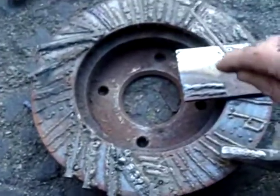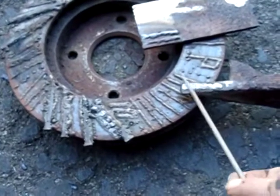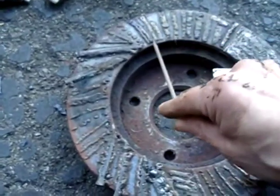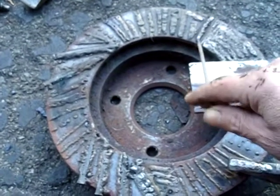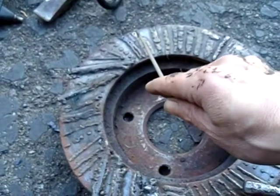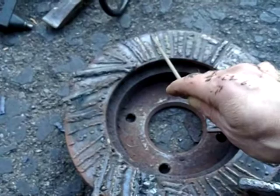I did a lot of welds on this rotor and most of it was coming out lumpy like this. So it works, it welds — it just doesn't look as pretty. But you can learn things like undercut, for example here. Another thing was happening: the welds would start off kind of cold, so the bead was raised and narrow, and by the end of the pass it was a little wider and flatter. You can see the obvious undercut at the end of this.